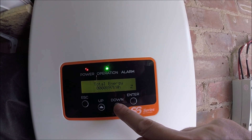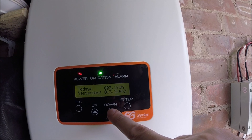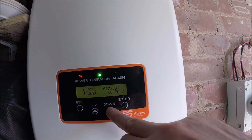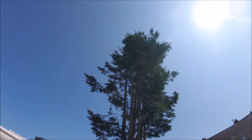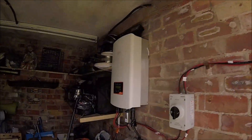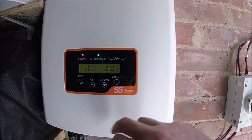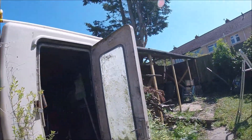The controller shows the current input — you can see 1,300 watts right now. You can go into the information and it shows how much voltage and amperage the different strings are producing. Flicking through, you'll see the total energy produced for the month and for the year as well. The analytics in the app show 13 kilowatts yesterday and 3 so far today. The string on top of the garage is producing over 6 amps, while the two kilowatt string is barely producing any amperage — purely because of the tree branches casting a small shadow on the two kilowatt panels.